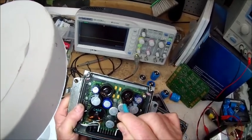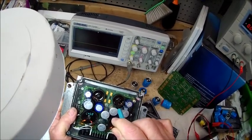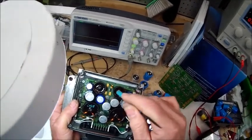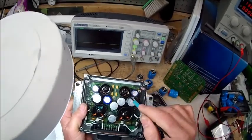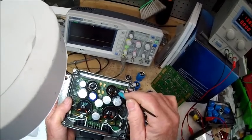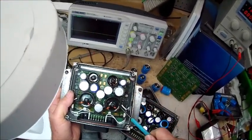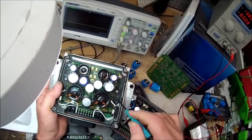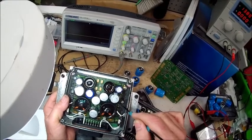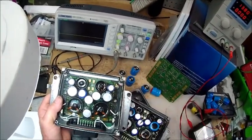The PWM chips are pretty interesting - they're a dual output channel component. Basically what they're doing is creating a signal that is going to be the 23-volt line on your coil pack, going through this inductor, which takes a tiny pulse. It actually goes through an array of diodes and transistors on the back of the board and some resistors, getting a nice signal, feeding it through the FETs. The FETs turn on and off, discharging the field on these inductors, and then into the big capacitors we get a nice voltage output - in this case, 23 volts on these guys and 180 on the others. The cycle of these FETs is 22,000 times per second, collapsing the field of this inductor to produce the nice steady voltage line going off to your coil packs.